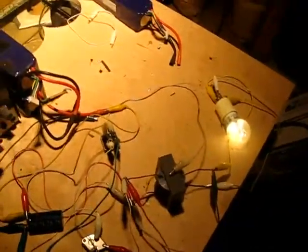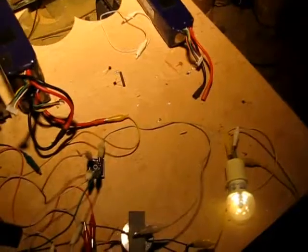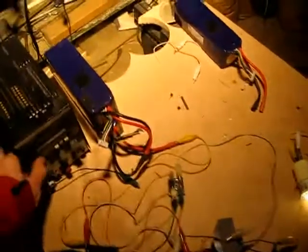So that gave me an idea to do some experiments with an inverter to provide the 50 to 60 hertz signal. This whole time the capacitor has been disconnected — well, I've got one leg connected to the battery pack here, but the negative side is completely disconnected. And this thing is just ringing on and on, just picking up the 60 hertz through the air from this switched-off power supply.